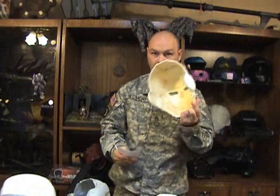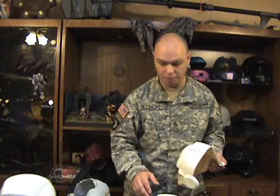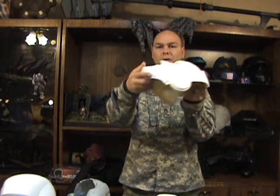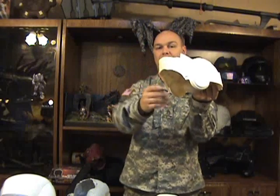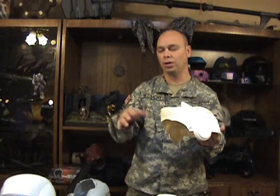That's another technique for unflat surfaces. Flat surfaces are too easy. It lays flat and you pour on top of it. You put it in a box, a cardboard box, or you super glue or hot glue four sides together, bead the edges with the hot glue so it doesn't leak through, put it flat, and you just pour on top. When you pour on this, it's not flat, so it would go underneath. So you have to build your dam. You'd have to go underneath it, and that defeats the purpose. With a flat one, you just pour on top.